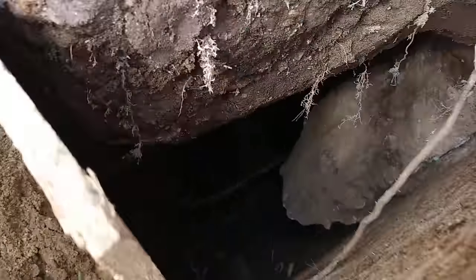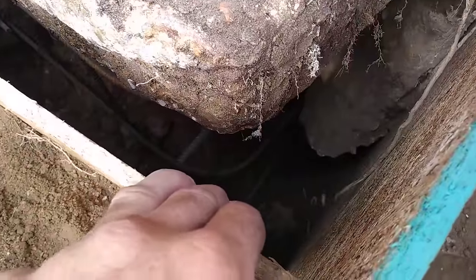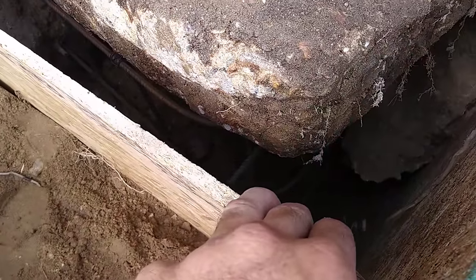If you look in there you'll see the rebar — it's a little hard to see with the lighting. What the rebar does is reinforce that concrete. In underpinning we're just coming up with a slurry to pack up and under the existing footing.